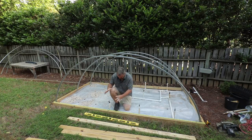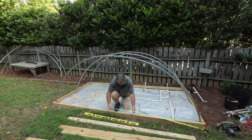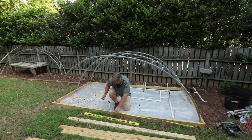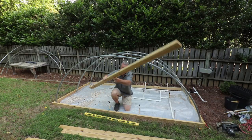The first thing I'm going to do is find the center of this board that goes across here — it happens to be right at 69 inches. I want a three-foot door right here, so I need a foot and a half on each side from the center, which is pretty easy to do. Using my tape measure, I go from the center 18 inches this way and 18 inches that way. Those are my marks for the two uprights that frame in the door.